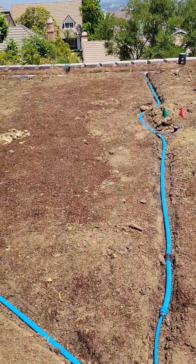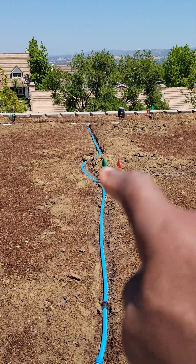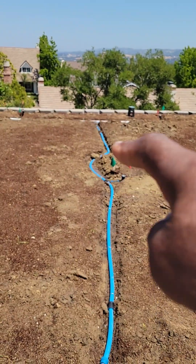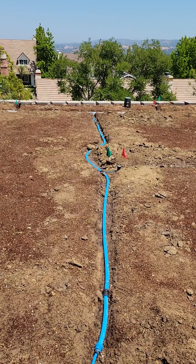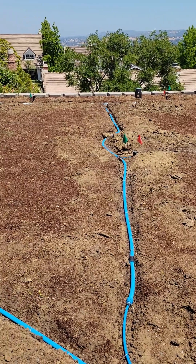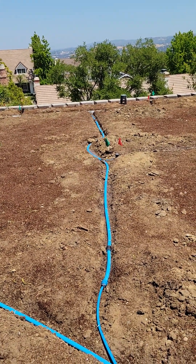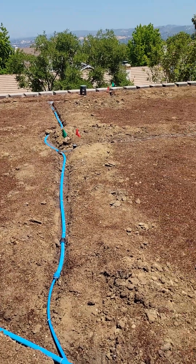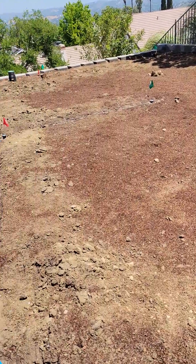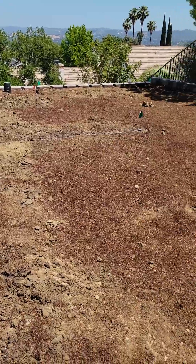We had a situation where there's a huge boulder down in there, so I was able to orient around it instead of trying to go straight through. We want to round that boulder — it's pretty deep — so instead of going straight we just decided to go right around it. We want to put another two to three inches of soil on top so we're okay from the standpoint of that boulder. There are quite a few boulders on this job site, which is good for holding the slope but not good when you want to do irrigation.